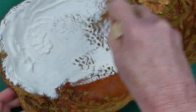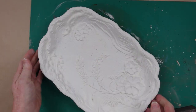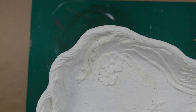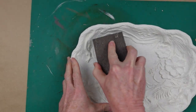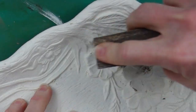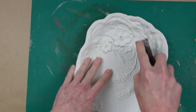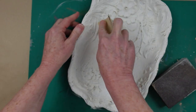This tray has little vines on the side and beautiful little floral wispies — look at all that detail just from putting the white paint on; you can really see it. You could leave your project just like this if you'd like, or you can do like I do and distress it. Since we used chalk paint, you could wet distress with a baby wipe, use a sanding block, sandpaper, or even an emery board or fingernail file to go around the edges.